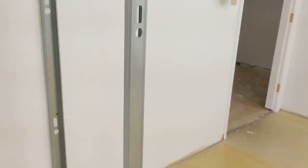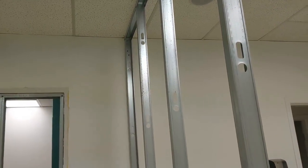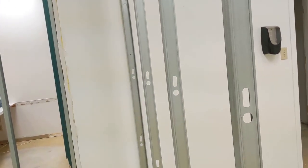When you're doing the stud, it's important to keep the holes in the same position, as you guys can see. Put the stud in the same position going up. You see the holes — they are in different positions sometimes, the top part is usually different. This is for the electrical or plumbing and all the stuff that goes through the holes to carry channel, and this keeps the wall straight forever pretty much.